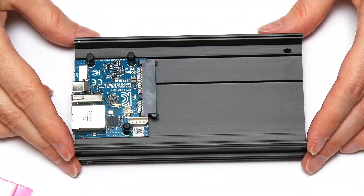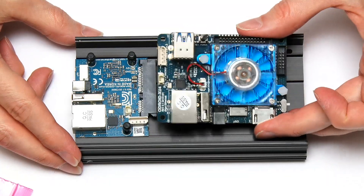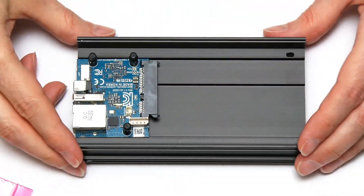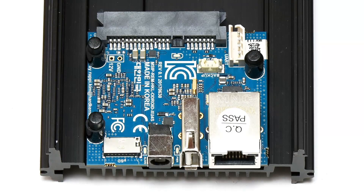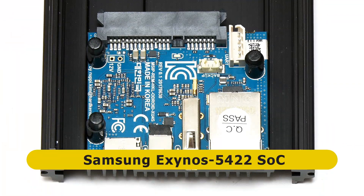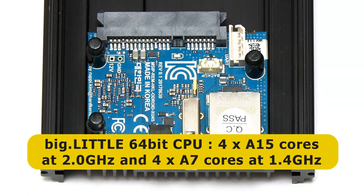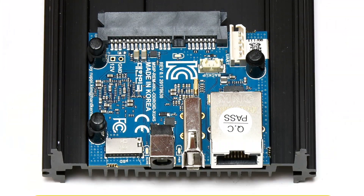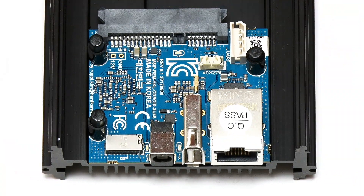And there, as you can see, is a very different looking single board computer. That's the board itself — the equivalent of what's left from an Odroid XU4 — and you can see the mount that holds everything together, with the SATA interface clearly sitting there. The system on chip is the same as on the Odroid XU4: a Samsung Exynos 5422 in a big.LITTLE configuration — an octa-core CPU with four ARM Cortex-A15 cores at 2 GHz and four ARM Cortex-A7 cores at 1.4 GHz. This is a powerful single board computer.